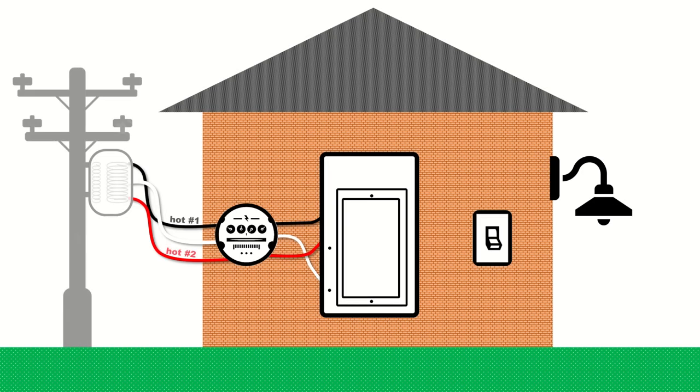Consider a simple case with hot wires carrying current from a power supply to an electrical load and a neutral wire carrying the current from the electrical load back to the power supply. In this example, the light fixture is provided with a live black and a neutral white conductor. The live or black conductor passes through the main service panel, through the light switch, and through the electrical load — in this case a light bulb — before returning on the neutral or white line through the main service panel and back to the source. Under normal circumstances, the metal casing of the light fixture would not conduct any of that electricity. But if there was a loose electrical conductor or some damage to its protective insulation, then the live power could contact and energize the metal casing around the light fixture or any other metal enclosure, conduit, or structure, creating a significant risk of electric shock or fire hazard.